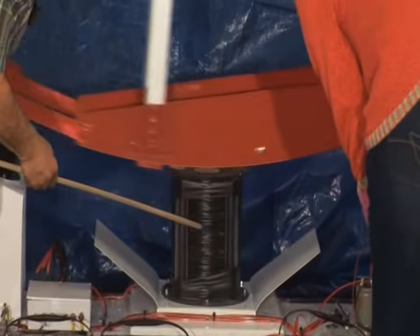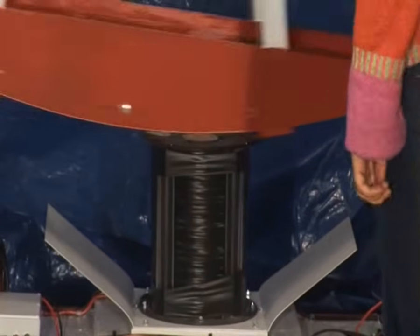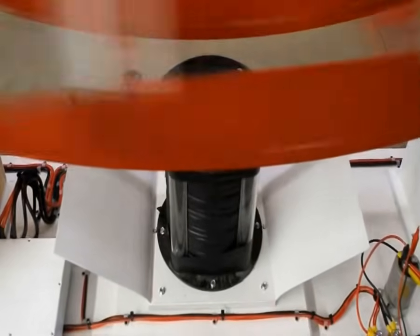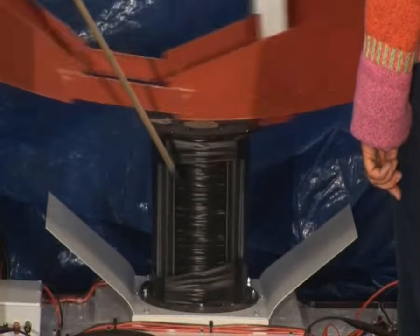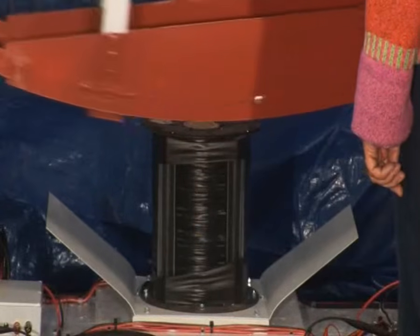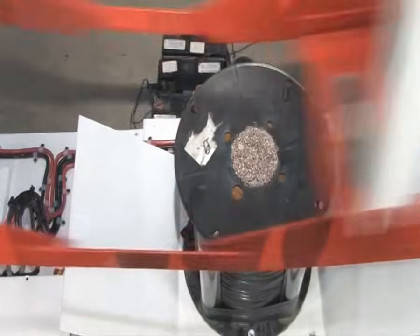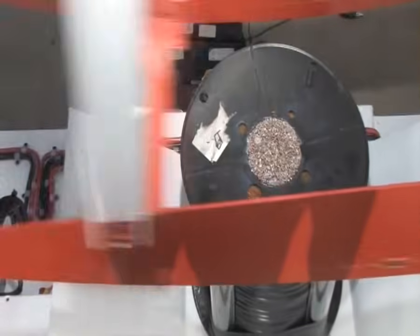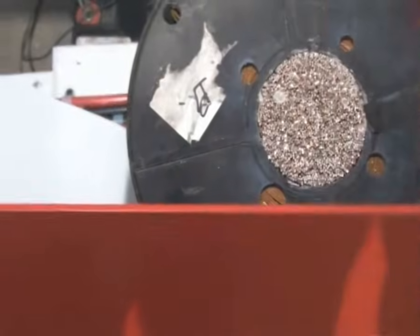And this master coil has about 150 to 200 pounds of wire on it. That's quite a bit of wire, because each one of these spools weighs 80 pounds. It has a 3-inch core made of welding rod. You can see it here. The reason that we use this welding rod is because each rod is copper coated and more or less insulated, to break up the current in the coil, the eddy currents, so that we don't get a big heating effect.